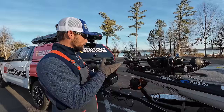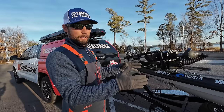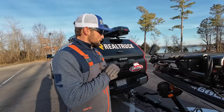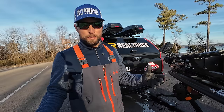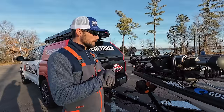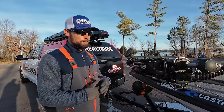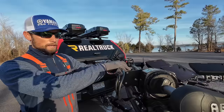The first thing you notice up front is the trolling motor - this is the new Power Pole Move and I'm super excited about it. I went with a 52-inch shaft, and I did that for a reason. Number one, this is the lightest trolling motor on the market so it didn't add any weight. It's also going to help keep my forward-facing sonar transducer - a Lowrance Active Target 2 - in the water when it's rough out there.